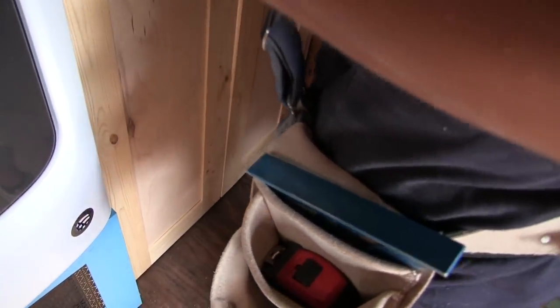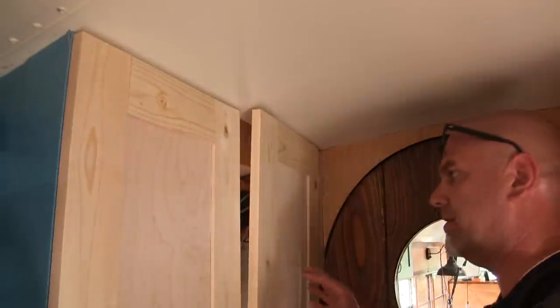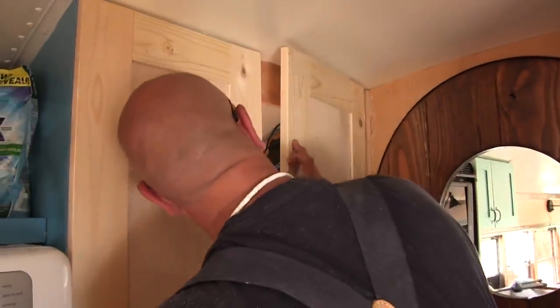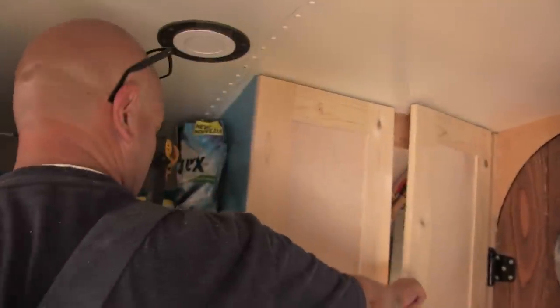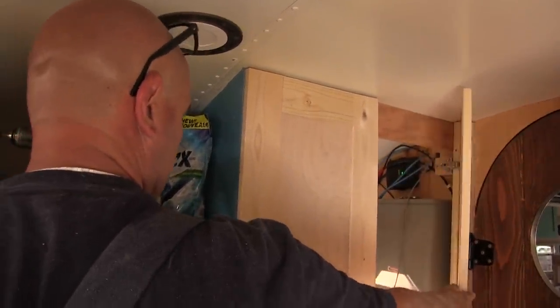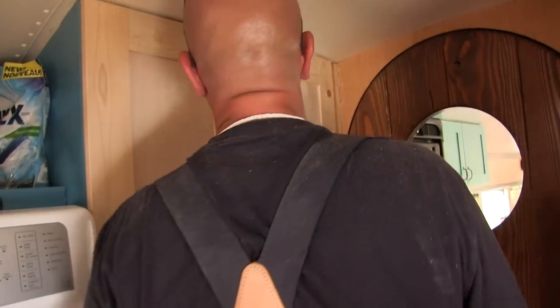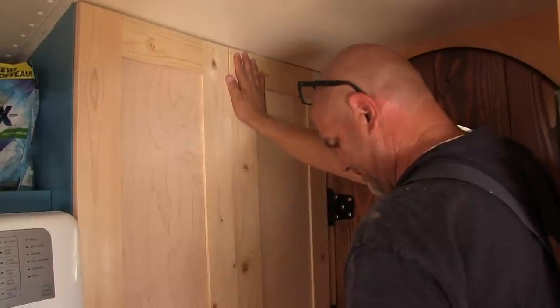It's like whack-a-mole — you get something to match up around there and it pops out somewhere else. What do you think it is, just the stupid boards being warped? Hard to say. It's such a bummer when your projects don't turn out how you were hoping. This door is warped really bad — that's the problem. Just hold it really straight in your arm and point it at me. Oh I can see it even just holding it like that. So it seems like we're just going to have to buy new wood and make a new door.